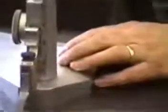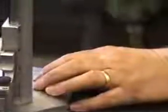And behind, at the very back, there's a handle, or a knob I should say, that we can rotate either clockwise or counterclockwise. By following our zero line on the scale, we can measure almost anything from 0 inches up to 20 inches, or from 0 millimeters up to 510 millimeters. So what we're looking for on our drawing is 17.5, our total width.